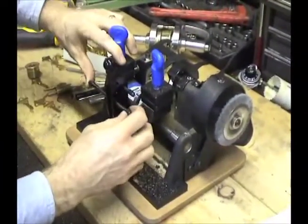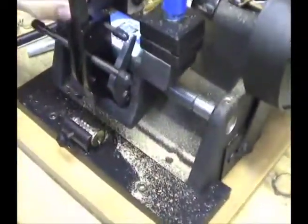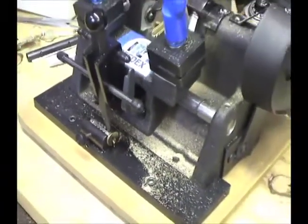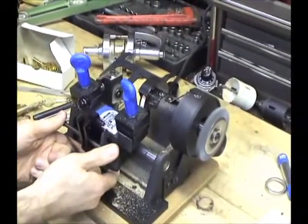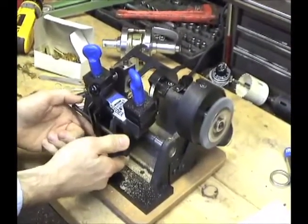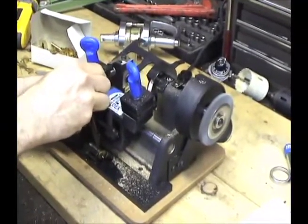Lift the carriage and place the pin reader into the first chamber of the plug. Hold the pin reader in place and slowly lift the carriage engaging the cutter. Move the pin reader from chamber to chamber, repeating this process.